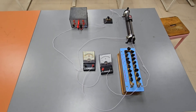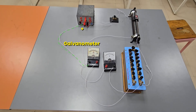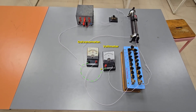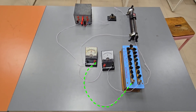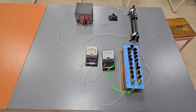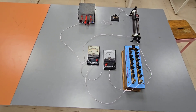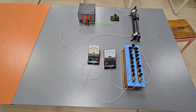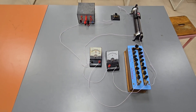From the positive of the battery to one end of the galvanometer; from that same end to the lower end of the rheostat and to the positive of the voltmeter. The other end of the galvanometer connects to one end of the high resistance box, and the negative of the voltmeter connects to another end of the resistance box. From that same end of the resistance box we connect to the upper terminal of the rheostat. The opposite lower terminal of the rheostat connects to the plug key, and the other end of the plug key connects to the negative of the battery. This completes the circuit connection for conversion of galvanometer to voltmeter.